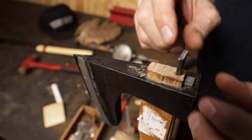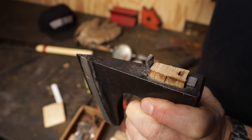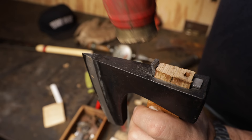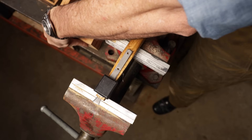I'm just wondering, would we be better off to use more of a Western style step wedge? This is so small — it's going to split no matter what we do; it was already split. I'm almost inclined to — we're spitballing here. That's pretty tight. Using a brass hammer here, trying not to ding that up because it is — I like the way it looks when it's got a sharp edge on it. The only thing remaining is to replace those brads. I ruined those nails getting them out; I don't have any steel ones, but I do have these lovely little copper spikes. The copper is so soft that you have to pre-drill it, because it will bend trying to set it in this hardwood.